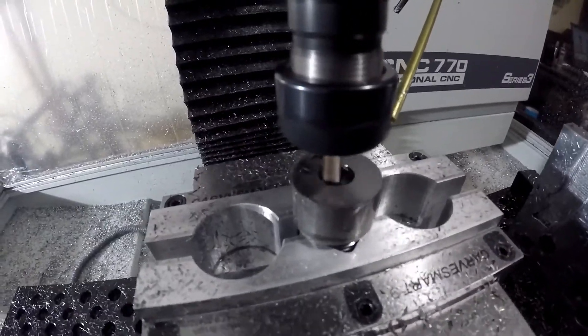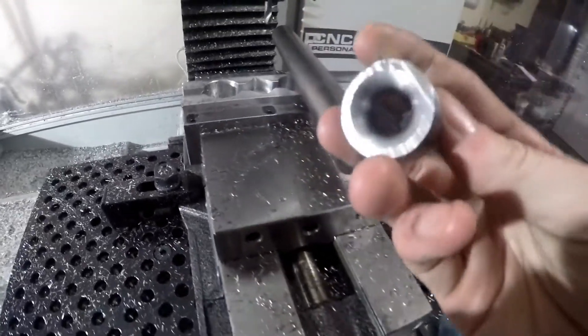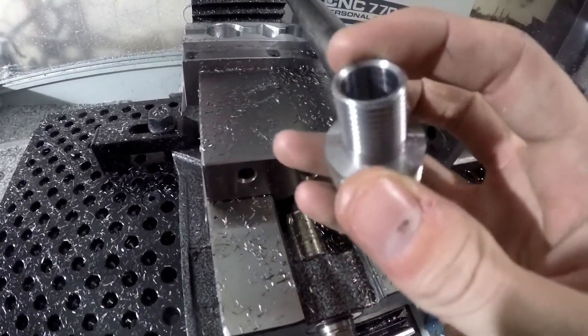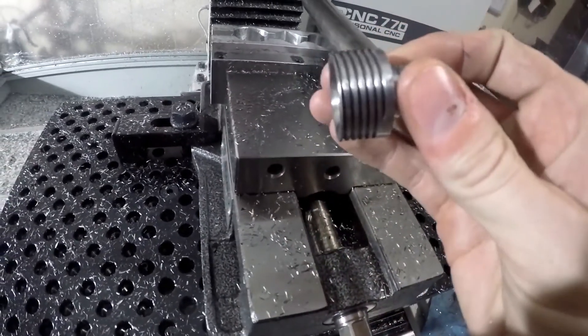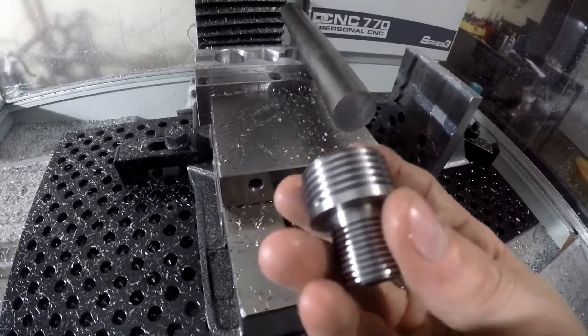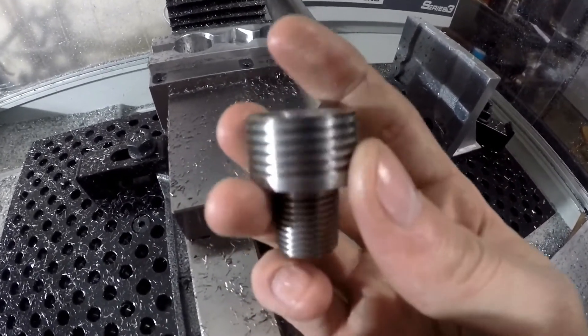Now I'm going to flip this thing over. I'll flip it over and do the other side — get it down to three quarters of an inch around, then thread it and finish the inside hole all the way through. This is really a pretty exciting project. So this is what we come up with after — this is absolutely amazing, I am definitely very proud of this project. I added a big chamfer right there, and this should thread into the block on the big side and the oil filter comes in on the small side. I'm definitely excited to try this out. I don't even care if it doesn't work — I'm just very proud of this project and how it turned out, even though I burned up a three eighths inch end mill. Not a huge deal though. This was just so fun to try out for the first time and make it from this huge piece — absolutely amazing.